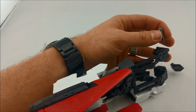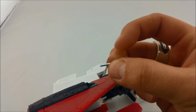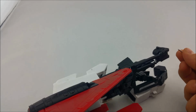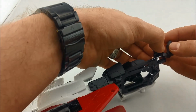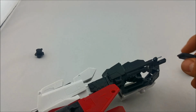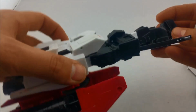So you can see, maybe, on film here, that one side of this pin is scarred, and that side is on this inside. That's where it was struck from. So you want it to go back in the same way when we put it back. So now this comes apart and our little problem piece is off. So we're going to set that off to this side so we know it goes with the other shoulder. Set the other pieces off on this side so we know they all go together.